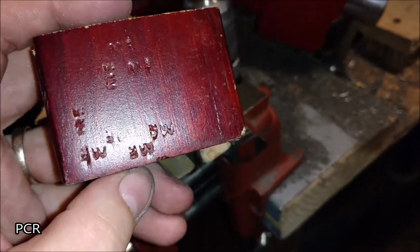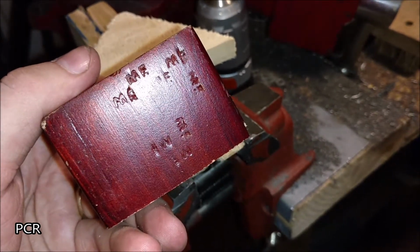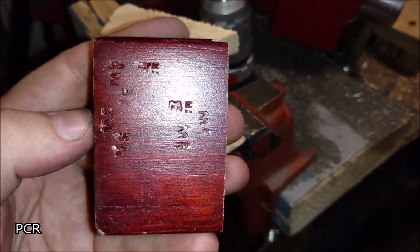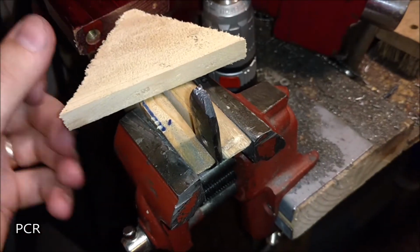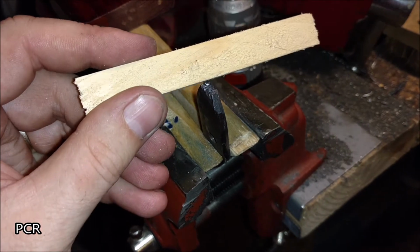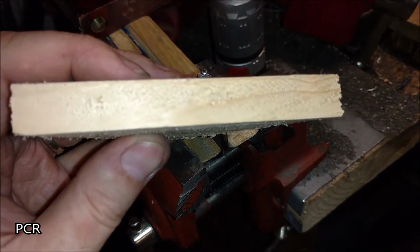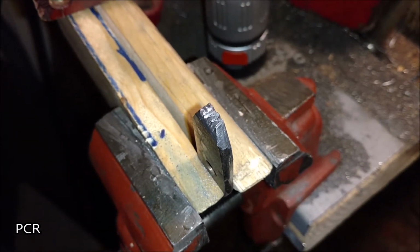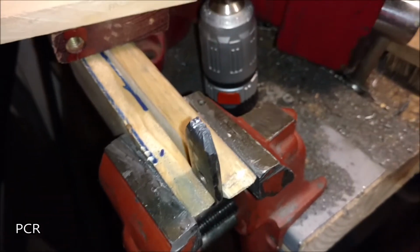Those you got to be careful which direction. The grain of that laminate will make it look horrible, like in this case between that C and the two lines, unless you turn it another direction. See, the one where the light is reflecting right now came out a whole lot better. What I'm noticing is the M is a little thick in my case. But, like my dad used to say, if you want it perfect, make it perfect. So, I'll make it perfect.